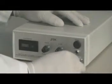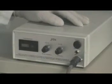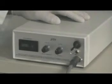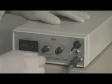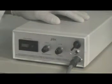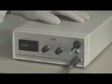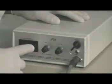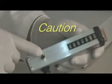To prepare for use, plug the laser into the driver unit. Insert safety key and turn right. Place your pulse setting on level 3. Place your intensity selector also on level 3. Reset pulse counter. Your laser is now live, and extreme care must be exercised while handling this instrument.